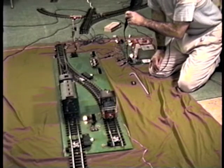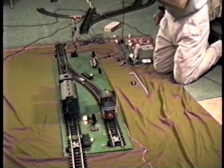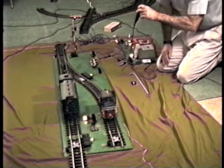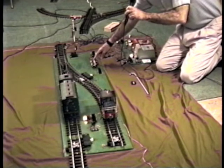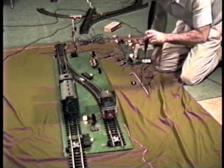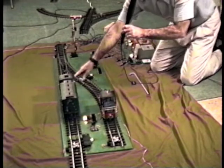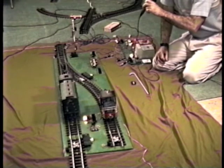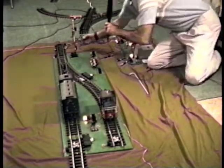The one other thing I need to talk about is the rheostat. This has two rheostats on it, the same as the automatic block. The forward rheostat controls the voltage in the on-off section. This forward rheostat, which I call R2, is not a real critical item. Its main purpose is just to drop the voltage a little bit in the on-off section so that when the block changes from red to green and the locomotive starts up, it doesn't get the full track voltage — it gets a somewhat reduced voltage and makes a somewhat gentler start. Let's set the block back to green and demonstrate that.